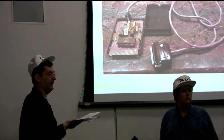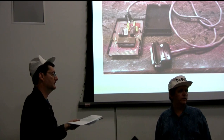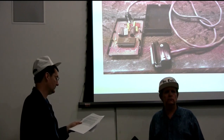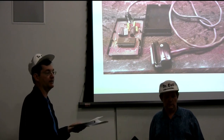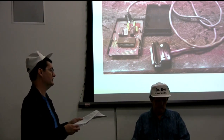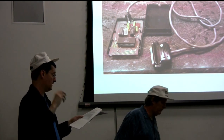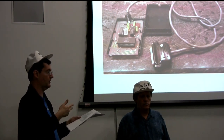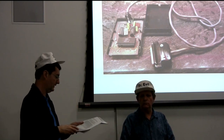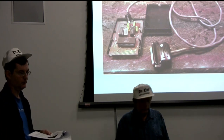We found that the Cypress chip didn't actually work as advertised. It caused lots of trouble - things wouldn't work and some chips blew up. Cypress first said we were sending too much voltage. We knew we weren't, but needed to show due diligence. Some modifications to the V1.1 and V1.2 schematics were about protecting signal lines from going over or under voltage. We put components in to keep it in a narrow band, and still the chips were failing. We'll talk about what we ended up doing. The work was really about proving our point to Cypress.